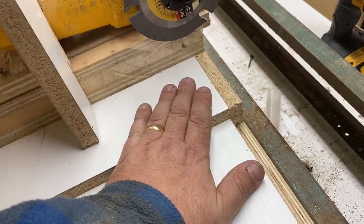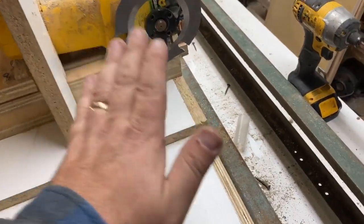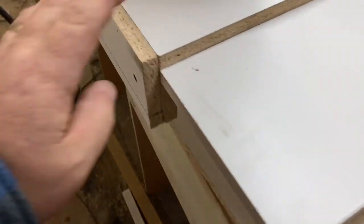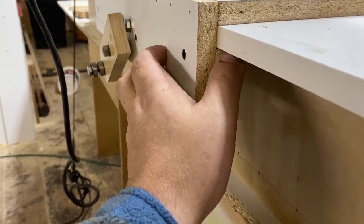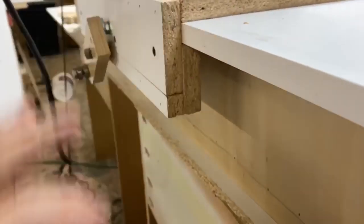There's plenty enough weight that's not going to come off, and any cutting where it's doing this — cutting from the underside — is going to be pushing down on that. But the back side, when I'm pushing my lever, seemed to lift a little bit. So what I did to cure that was to just run this piece down a little bit further, and then I ran this piece up just slightly, not quite touching this right here.